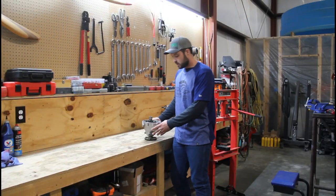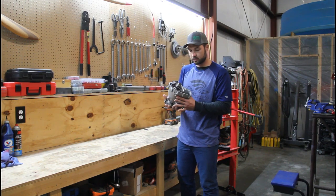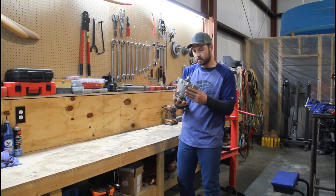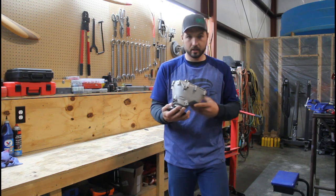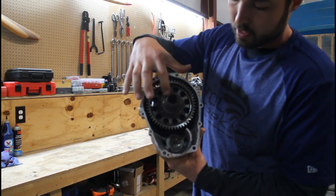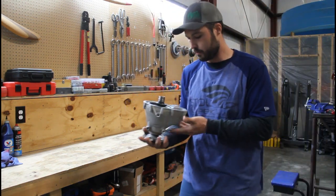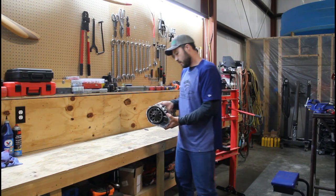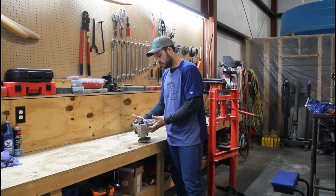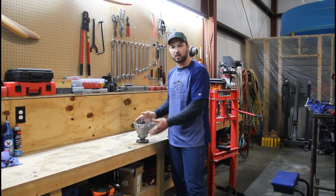Okay, so I got this gearbox off of that Highlander, the 912ULS, now. Got that in our hand. We're gonna disassemble it. We're gonna stick it on the press and we'll be able to press down, take our ring halves out so these gears, the clutch pack, dog hub, and everything can come out of there. And we're at 600 hours on this engine and gearbox. Don't expect to find anything wrong.